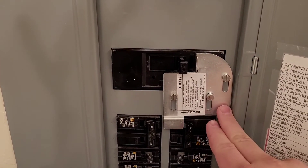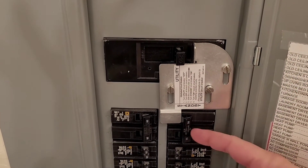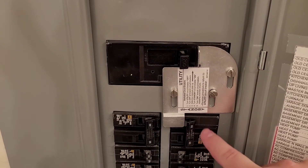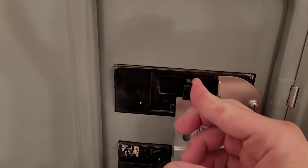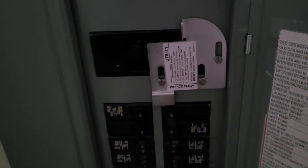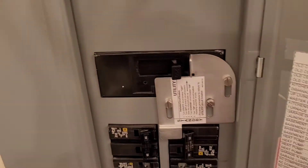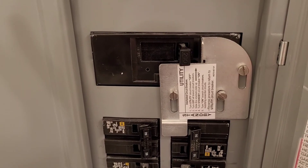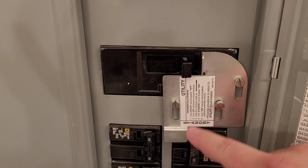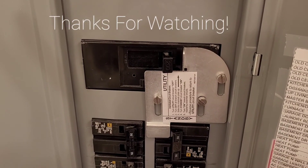This is a device I have for my panel — my panel is a Square D Home Line panel. What this device does is it blocks me from being able to turn on the circuit where my generator power hooks up. I can't have that flipped to the on position while the utility power is on. I have to first kill my utility power, then I can lift this up out of the way and turn on my generator power. The reason for that is so that if there's a power outage and you're going to back-feed your house, you make sure you are not feeding the grid — you don't want to zap a worker on the line, and you don't want to power all your neighbors' houses because you'll overload your generator pretty quick.